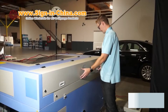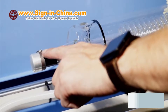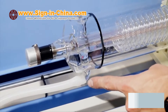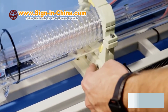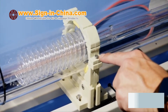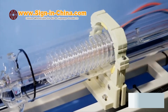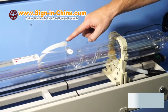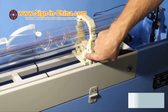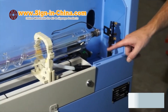Now let's look at the laser tube components. The 118-watt tube has a cathode, water inlet, back base, adjustment knob, tube tightening back clamp, water cooling channel, water outlet, front base adjustment knob, tube tightening front clamp, and anode.